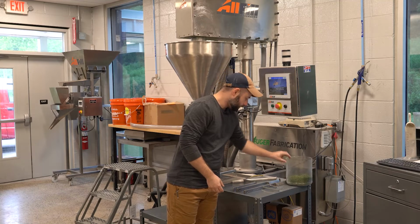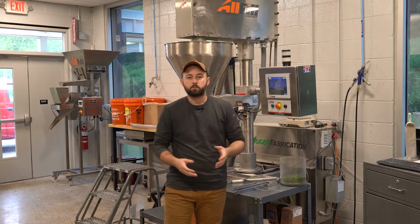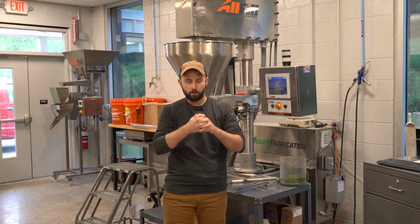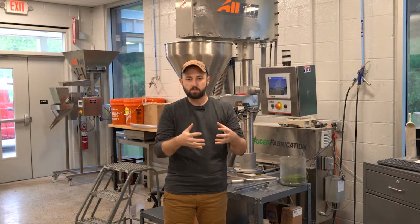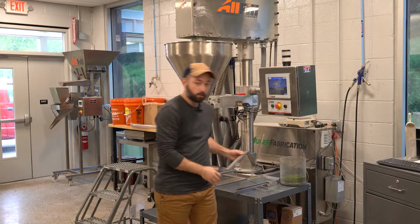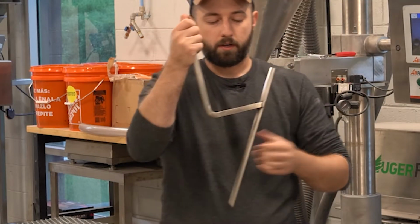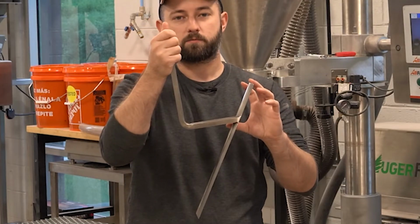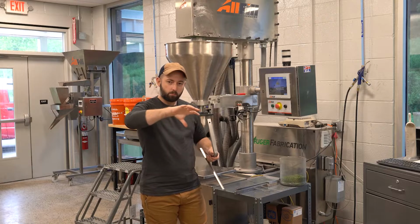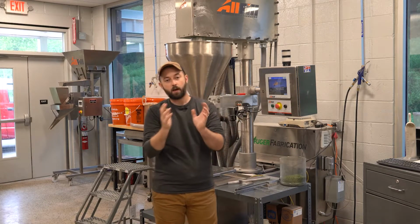The surface of the auger filler hopper is pretty smooth. It's polished stainless steel. When you add a light density material like a parsley flake that is able to hook and kind of grab itself, and its density is so light, you run into the issue with a standard slow speed agitator like we highlighted in the other videos. It looks like this. As it sweeps the outside of the hopper, it's actually grabbing the entire mass of material and dragging it around the hopper. So you'll either see it skip or the entire mass will actually spin inside of the hopper.